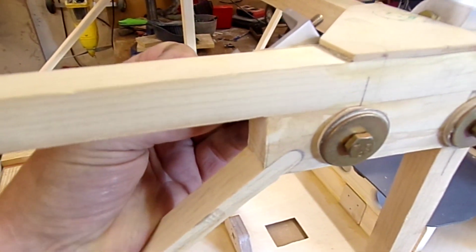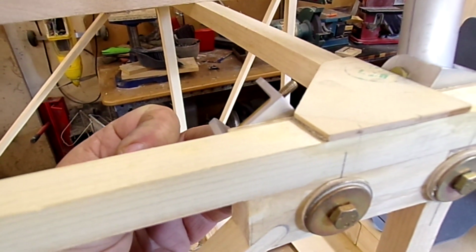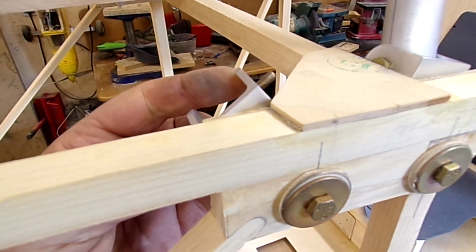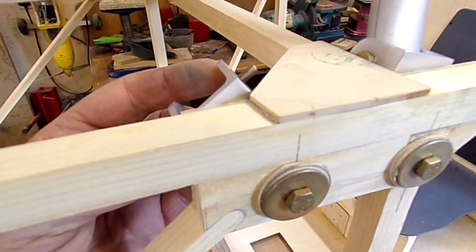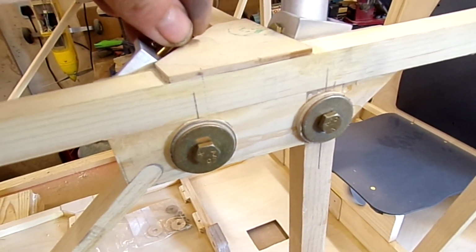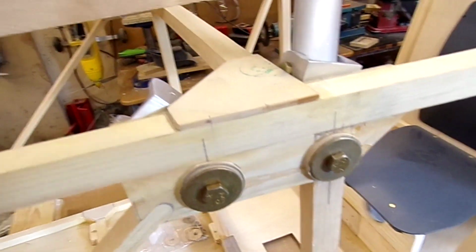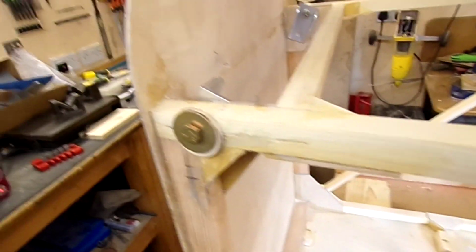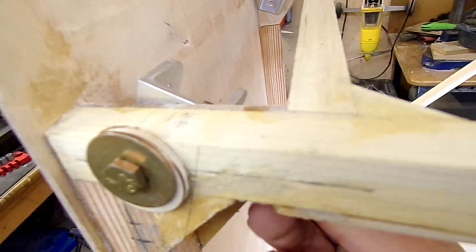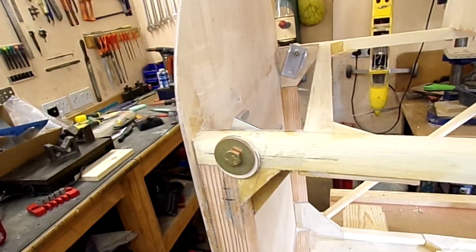So that's going to need a thin washer under the head, would bring it just down perfectly, and a washer under the nut there will be absolutely spot on, I think, so that we've got the nut in safety. This one will probably go through that way, but I don't know if I'm going to have enough room to be able to do that, and it's tilted up into its right position because of the bracket here, that gusset. And for the front ones here, it's got to go through that way because there's just no space to get a bolt through from the front.